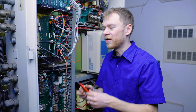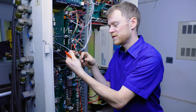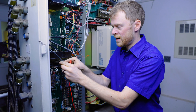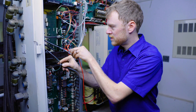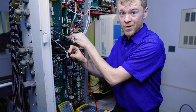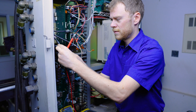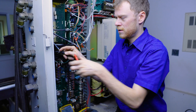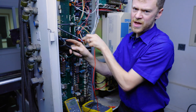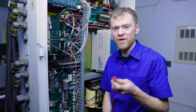Since you might not have a megger, let's check with an ohm meter. This is the A axis — there's no rotary table, so let's check the Z. I'll stick the lead in there with resistance set and measure — that's not good, two meg to ground with just an ohm meter. Let's check Y — that is not good either. If you see any reading on your ohm meter, you've got to get a megger or separate it and try to figure it out.